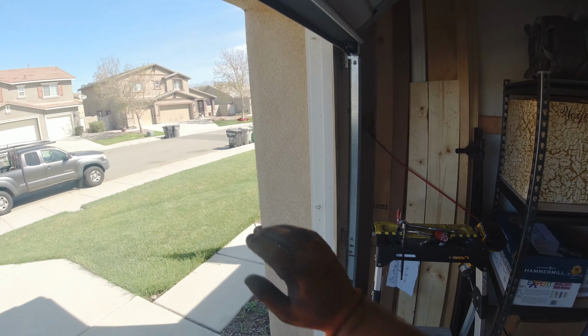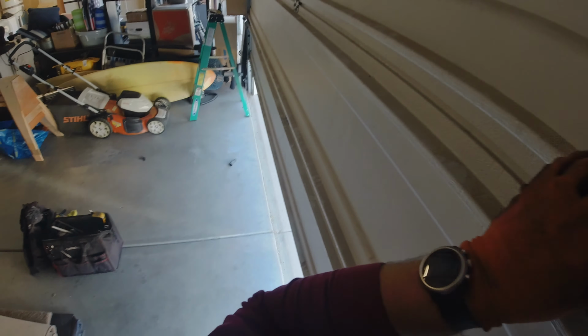Okay, so don't forget to take off your vice grip that's holding in your spring. Looks like there's sufficient tension on the cables on both sides. Let's check the balance of the door. That's not bad. Very good. So it took about 16 turns. I say the balance is good. It might be a little bottom heavy. Nope, yeah, right there it does go down by itself. It's at almost the 1 foot level. You can add an additional turn or perhaps a quarter turn if you want a much tighter balance. But for this specific door, the Wayne Dalton 9100, this is perfectly fine.